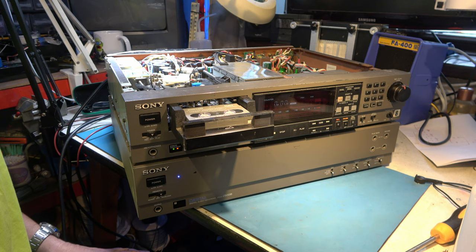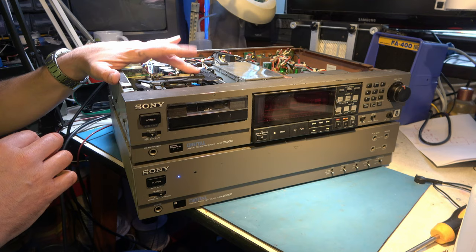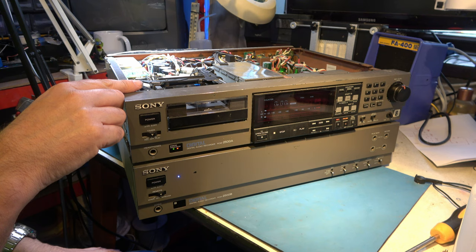But when it comes to closing it, what I have to do, it gets all stuck about there. Power it down, manually drive the deck in. Right, so the tape's going down now. When I've wound that fully down, power it up. It laces up. So that's quite good.